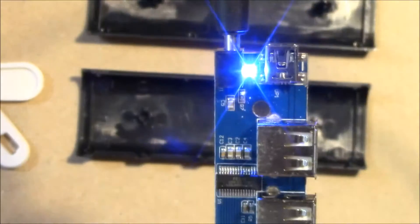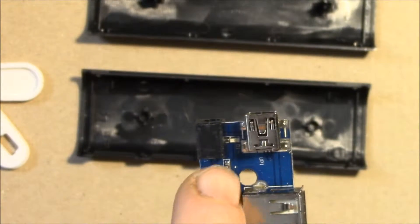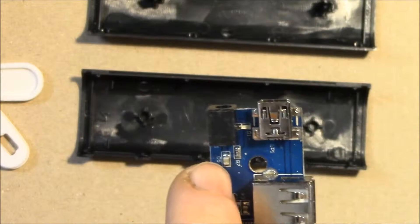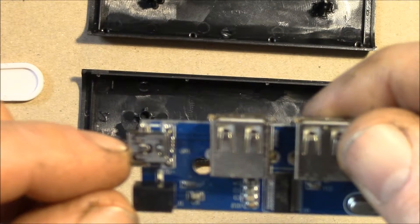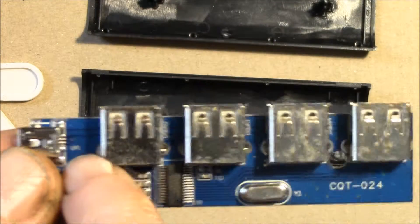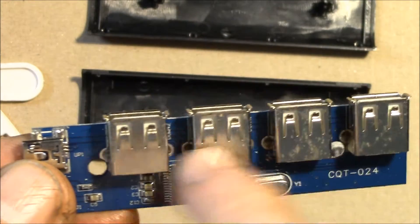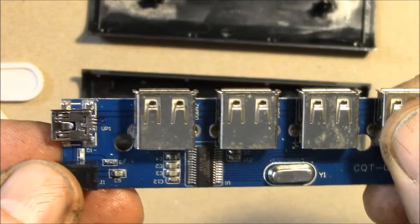So if we go in there, all that is, they have a 330 ohm resistor in series with the LED. There's a little capacitor there, and otherwise the power comes in from the jack and it looks like it joins up with the power from the incoming USB. Then your power runs along a trace that runs all the way down that each connector picks up — so that's your incoming power.